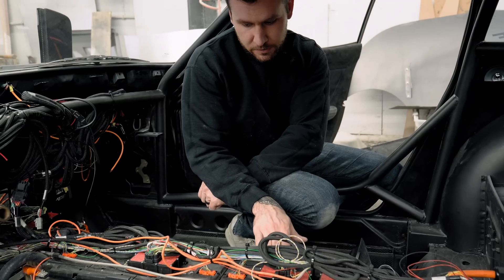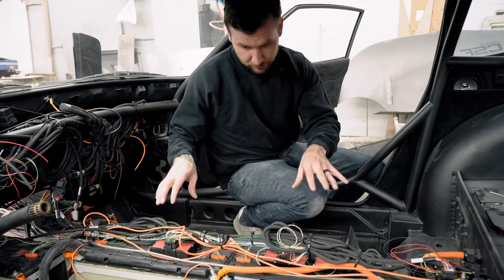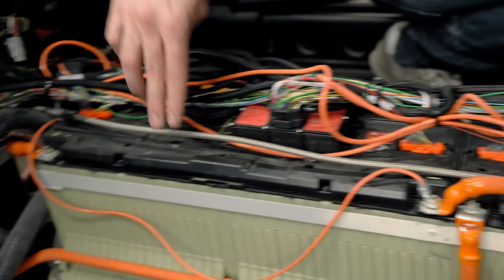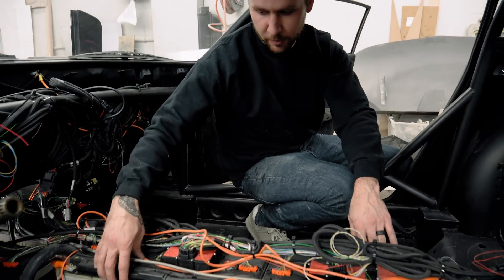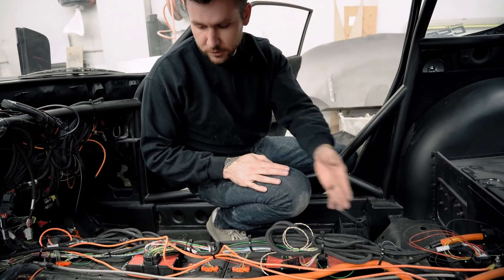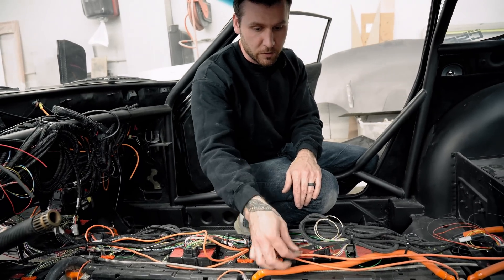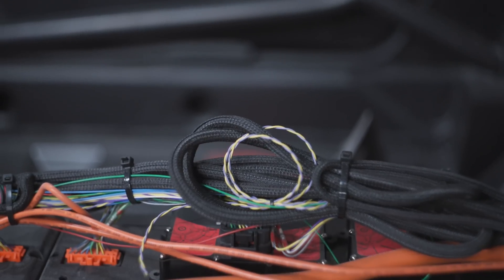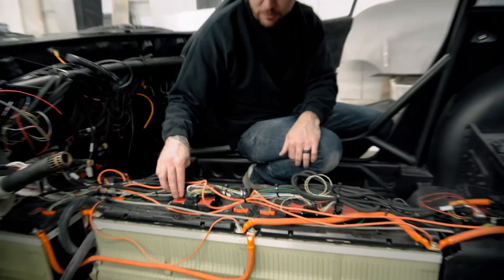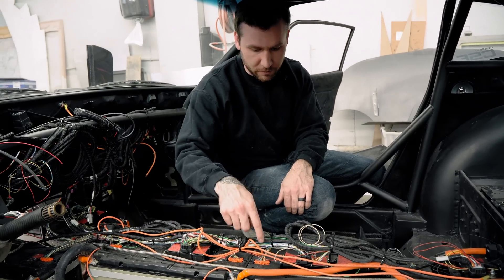I have a master and then five satellites following, and then I have two separate systems — battery system A and battery system B. Since I wired it up that way, we're monitoring them separately. I have two masters: one for system A, one for system B. It always starts at the negative-most point on the battery, and then goes through each one. They only talk to each other over a twisted pair CAN bus line — all the power that the satellites get is literally through just two wires. It looks like a big jumbled mess because there are so many battery cell taps — four-volt cell taps coming out of each of these.